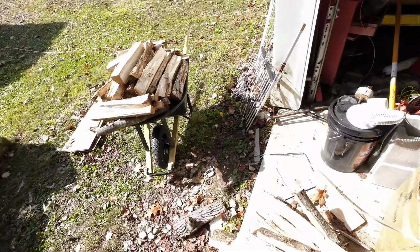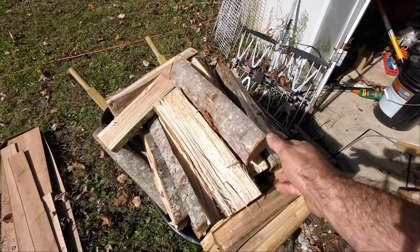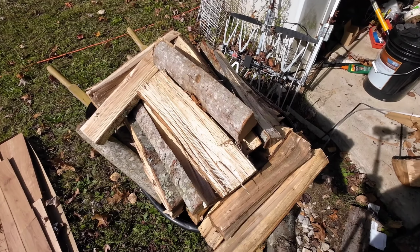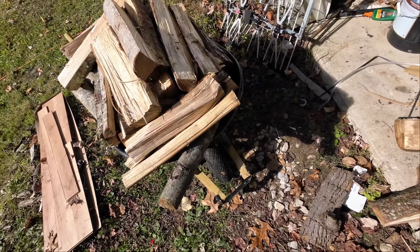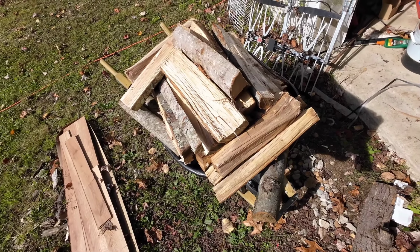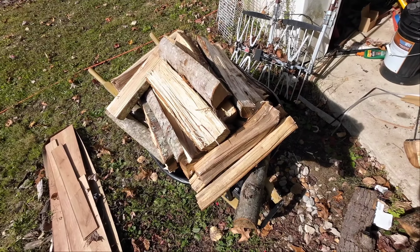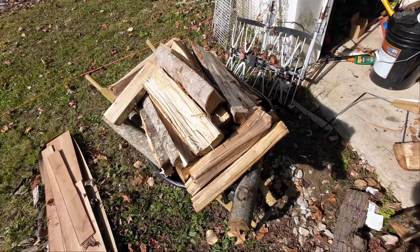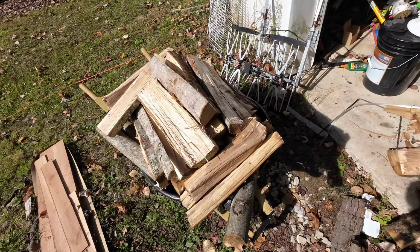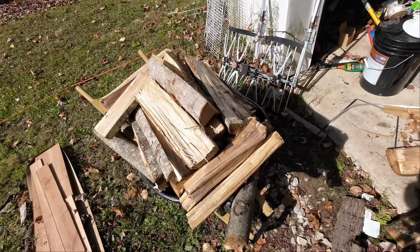We are going to be using this kind of wood stuff that's kind of smaller. That's maple. And pretty much most of that looks like it might be maple and maybe just a little bit of beech in there, possibly a little hickory. But we're going to take all this, load it up in there. The kiln holds a little over 4 cubic feet, and obviously on the next run you're going to see we're going to have it rebuilt up. But if nothing else, if you want to know the results, feel free to jump to the end, and I'm going to basically give you moisture readings of all this stuff after 4.5 days, 5 days with acclimation.